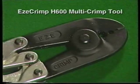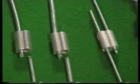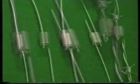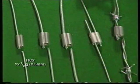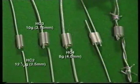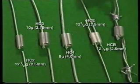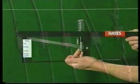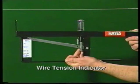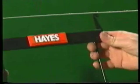Easy Crimp joins fencing wire 100% strength with a choice of 4 crimps: 12.5 gauge 2.5 mil, 10 gauge 3.15 mil, 8 gauge 4 mil and 12.5 gauge 2.5 mil barbed wire crimp, plus 12.5 gauge 2.5 mil electric wire connector crimp. The wire tension indicator measures the tension of strained fence wire, so you can tighten the fence to the manufacturer's recommendations.